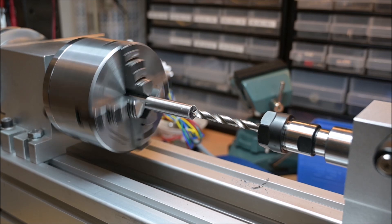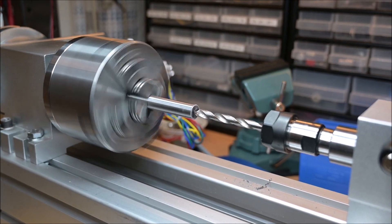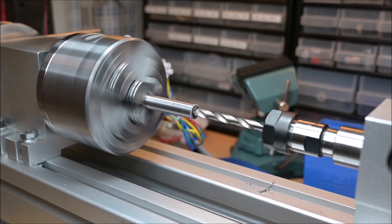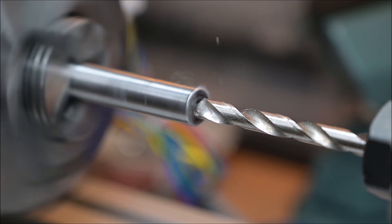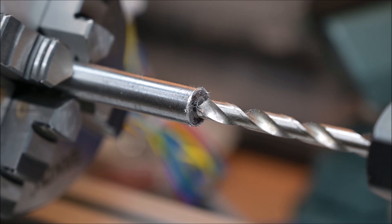It's a 6.5 millimeter drill. This is what happens when the stepper stalls, and this was caused because I was a little bit too fast with the drill. Also, you have to remember that this is dry drilling — no lubrication at all — so maybe it's not optimal.